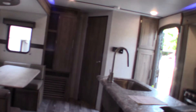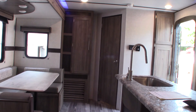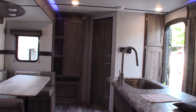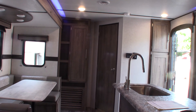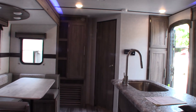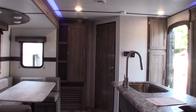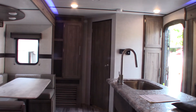First I want to thank you for purchasing your trailer here at National RV Detroit. And second, I want to remind you — as always — inspect your roof on a regular basis. Any place you see caulk from the factory, inspect that on the trailer. Once in the spring, once in the summer, once in the fall, go up there and check every place you see lap sealant on the roof and look for cracks or separation. These things flex down the road — not just this model, every trailer ever built. Check the seals and sealant and check your vent covers and roofing material. If you do that regularly and take care of any problems that arise, this thing will be bone dry 20 years from now.